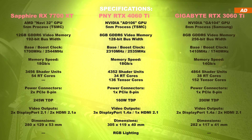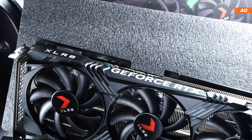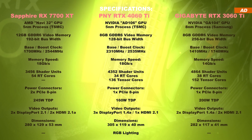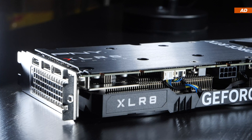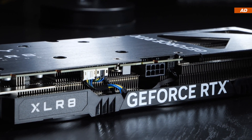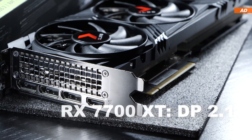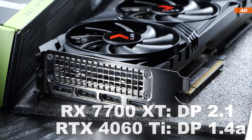Let's do a quick side-by-side comparison, also including the predecessor 3060 Ti. In addition to the new architecture, we also see the more advanced 5nm process on the 4060 Ti. Both cards come with 8GB of GDDR6 video memory in the standard version. However, the 4060 Ti has a bus width of only 128 bits, on paper still achieving higher memory speed. At a TDP of only 160W, the latest model should be easier to cool and much more power efficient. What's a bit of a bummer is that NVIDIA still uses DisplayPort 1.4a, while AMD's current Radeon lineup already sports DisplayPort 2.1.